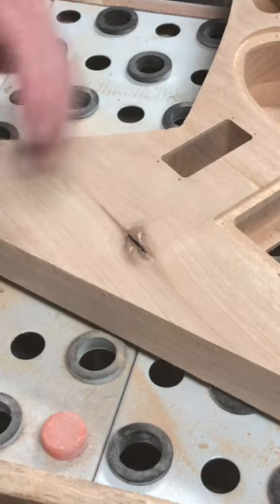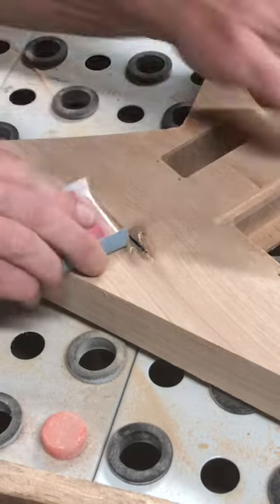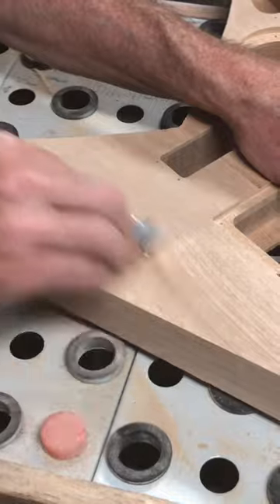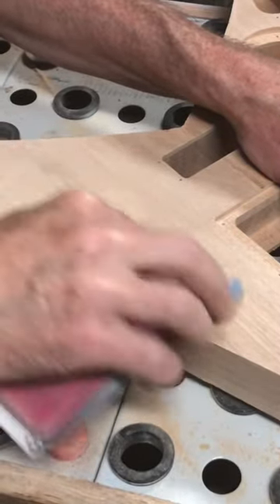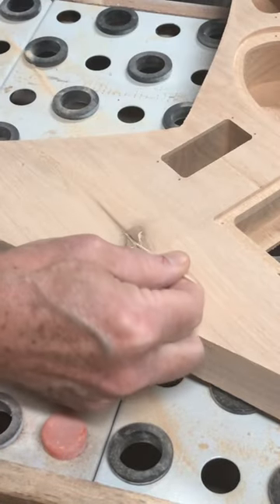This is how I fill the knot in a guitar body. First thing I do is sand the area around the knot with 80 grit sandpaper and work up the sanding dust until it fills in the knot. Make sure I get that dust packed down in there.